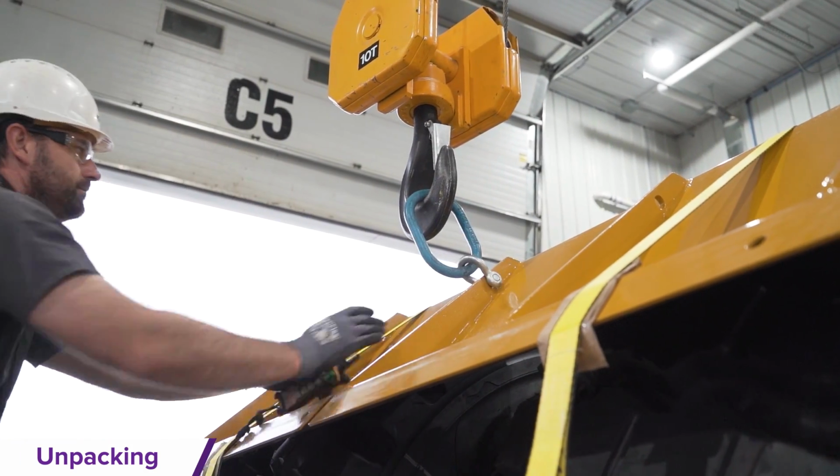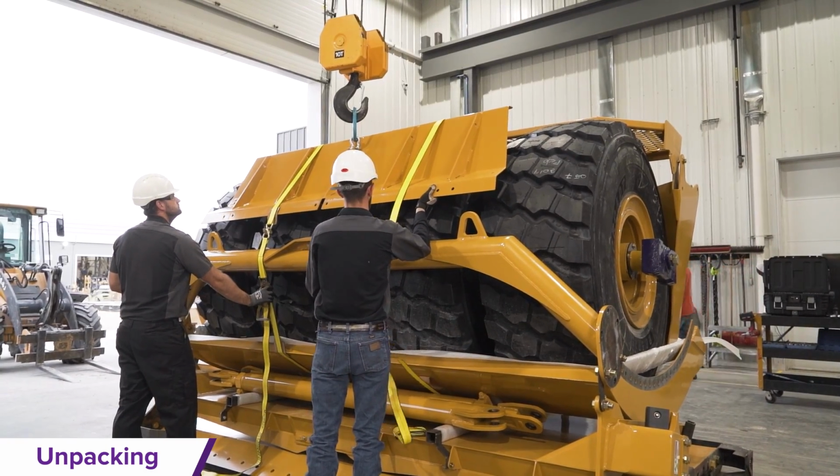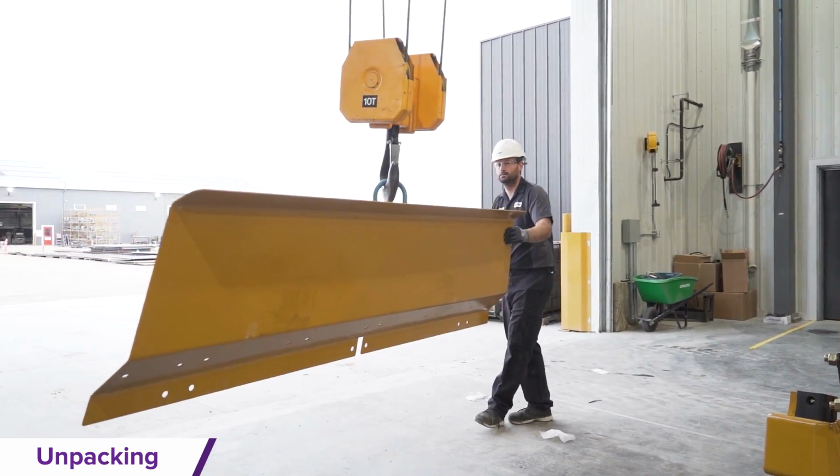Start the assembly removal process by first focusing on the small skid's rack extension assembly. Release the ratchet straps and attach a clevis in the center of the rack extension to lift and place it in your assembly zone.